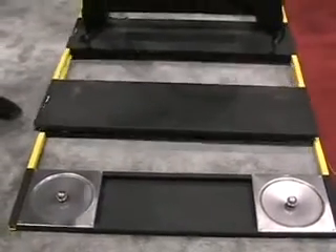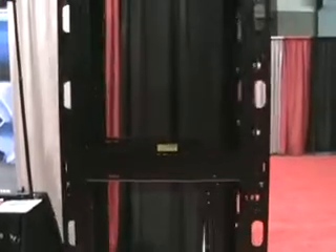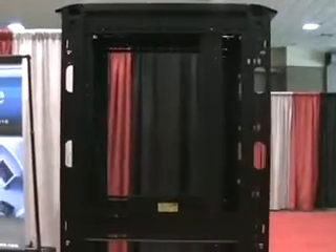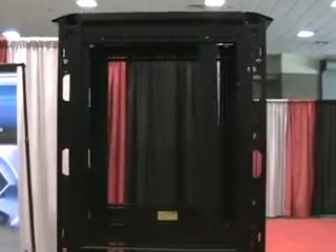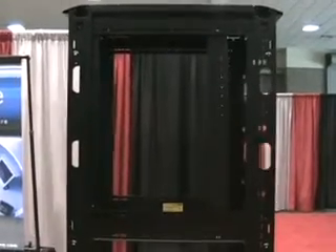The ball and cone technology has been around for years and is very well understood in the engineering industry. It's used in bridges and buildings around the world — the San Francisco City Hall is base isolated. And here in Washington, the Office of Emergency Management at Camp Murray in Fort Lewis, the whole building is base isolated. This technology has just been miniaturized for small mass equipment and has become a huge success in Japan and during the Nisqually earthquake that happened here in 2001 in Seattle.